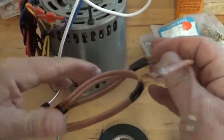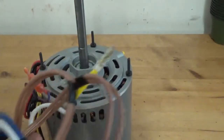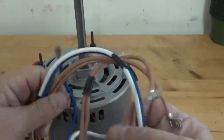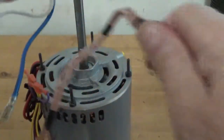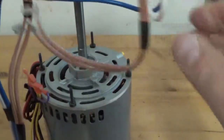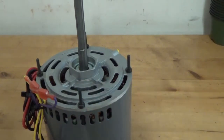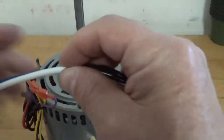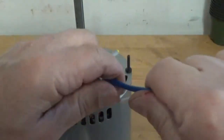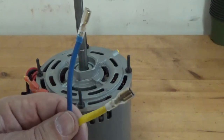That's my yellow wire. My capacitor wire seems especially long compared to the ground wire, but I can double it up and wire tie it if needed. I'm done for now, waiting on the squirrel cage since I'm going to replace it and not just clean the old one. These wire bundles are separate because they go in different directions — the capacitor wire goes to the side, and these go up through the panel to the control boards and common on the transformer.